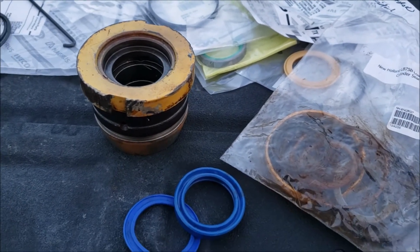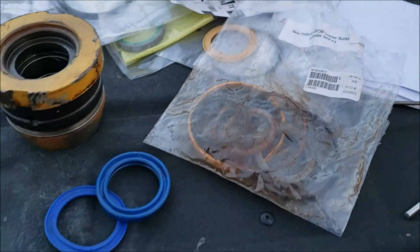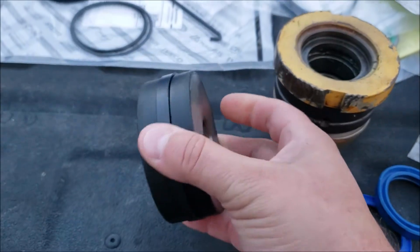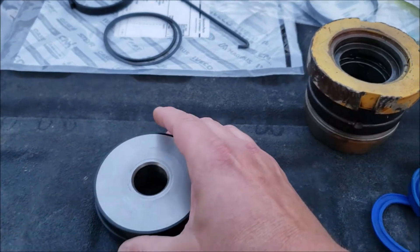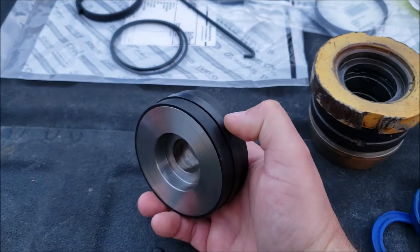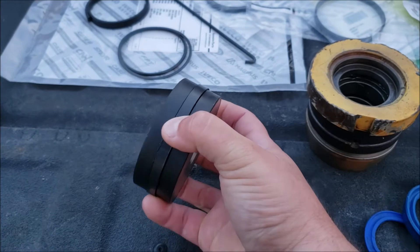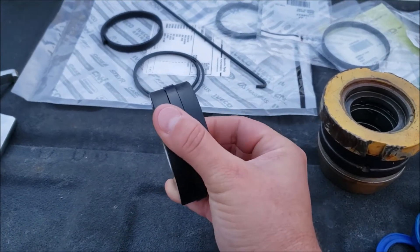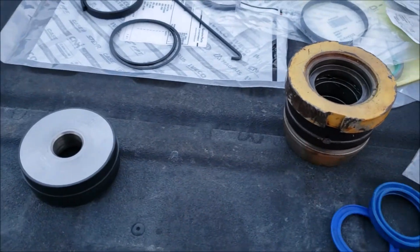When I took this apart I like to keep track of the seals and match them up to the kit. The first thing I noticed with the aftermarket kit was that the seals didn't match up. The seal for the plunger part of the cylinder - that went on fine, pretty much an exact match to what came off. This outside seal is a two-piece seal: there's a rubber seal underneath that you stretch over, then a metal band goes on top. That part was easy.